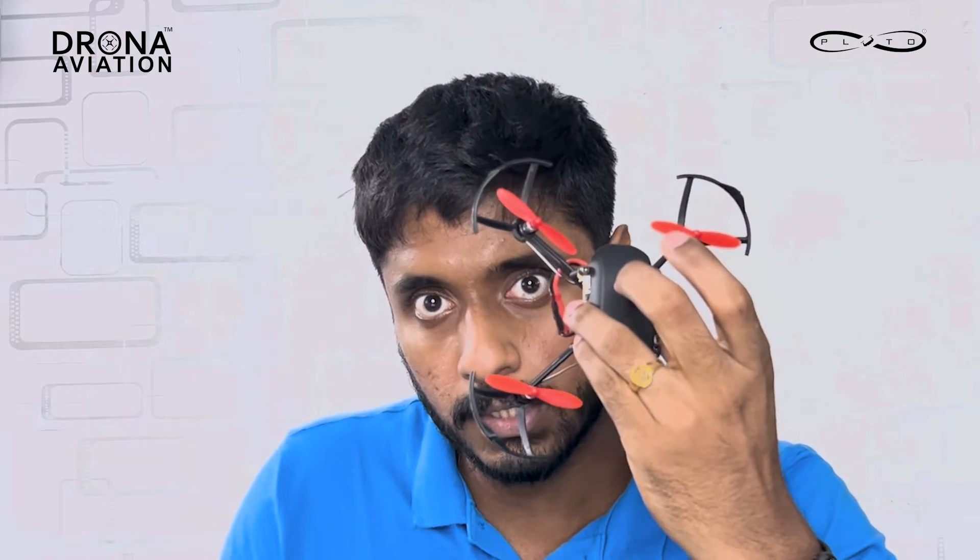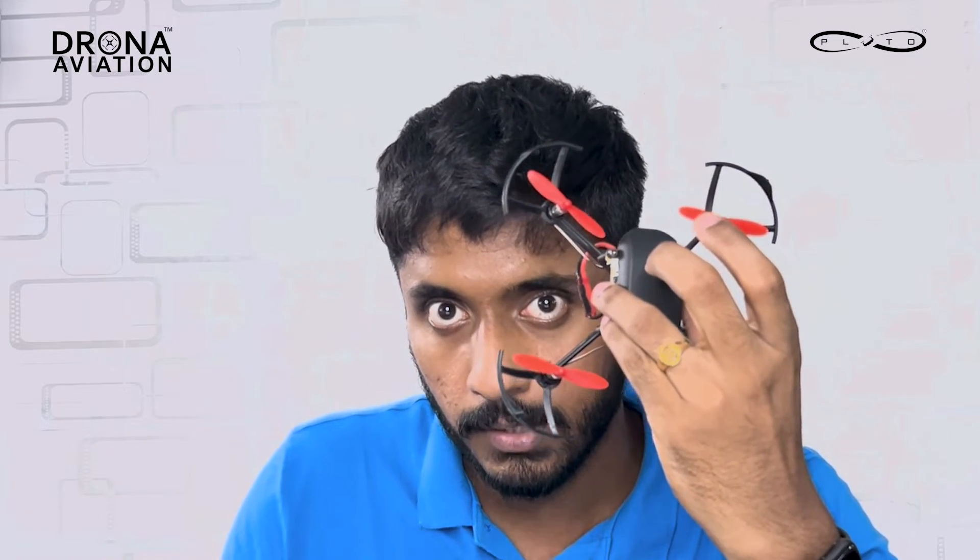If you remove the canopy you can see there are some LEDs inside it — we have kept blue off and blue on. Coming to the technical part: this gripper we basically want to open and close. Right now I am not pulling it more than needed because it is an electromechanical component, so we need to use PWM values.